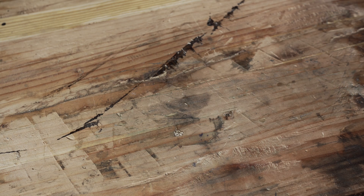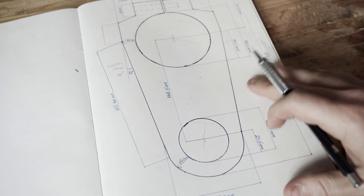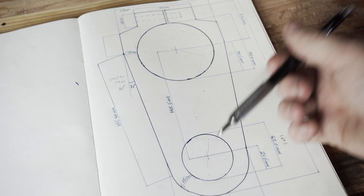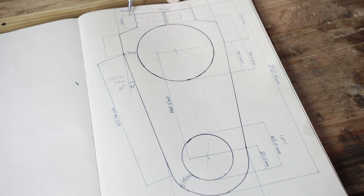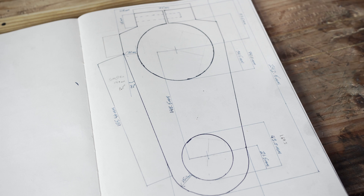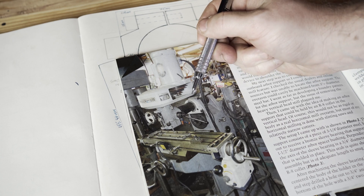So I looked through the stock that I have and came up with this plan. This is essentially a replica overarm support. You can see it's got the large bore for the overarm arm, and then there's a smaller bore that accepts the outer diameter of the shims, just like the article. You basically put the whole arbor plus shims through this hole and then it's clamped on the top. This is identical to essentially the stock support arm except that this diameter is larger. Rather than taking the whole vertical head off, I will just leave it mounted permanently on the vertical head, kind of off at an angle. The idea is I'll just leave it clamped here when it's not in use.